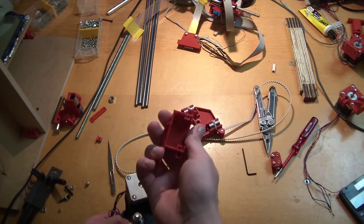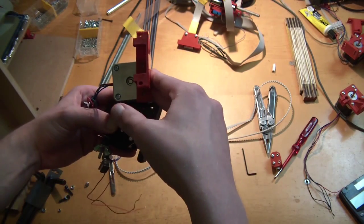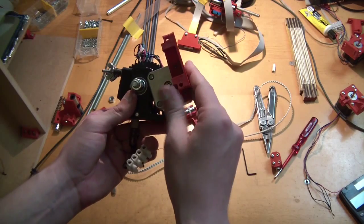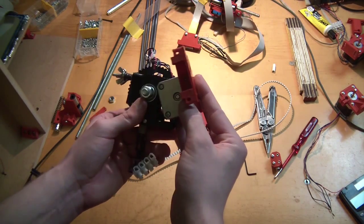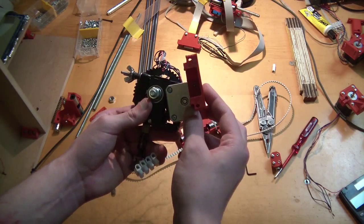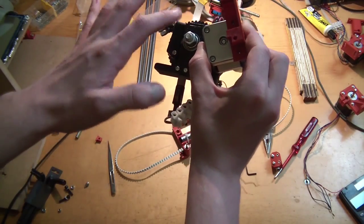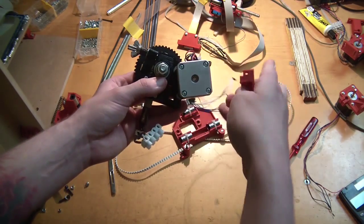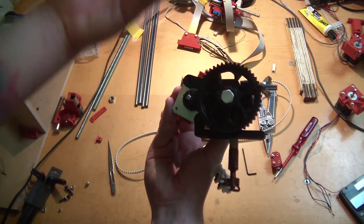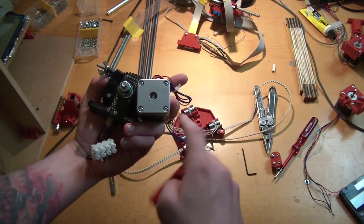Now that you've soldered it all in, you need this part right here — that is what houses the connector. It's meant to go to the right side, like this. If you have the modified extruder of the Mendel 90, you can screw it in here — just remove those two screws and then you screw them in again. If you have a normal Wade extruder, in a normal Wade extruder this will be the front side and this will be the back side. With the special extruder from the Mendel 90, this will be the front side and this will be the back side — so it's mirrored along this plane.